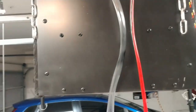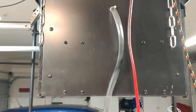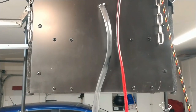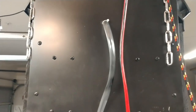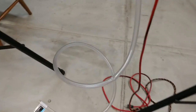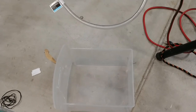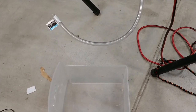Here we have the condensation drainage pipe. As water builds up inside, you get a lot of drip from the splash of the foggers as well as condensation. To keep that from building up, I have a drainage trough inside the fog screen that feeds this tube, and the hose runs into the water tank. So any condensation drip-off goes back into the tank.